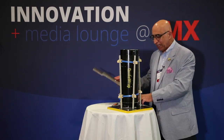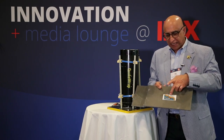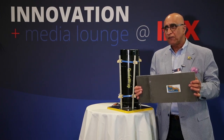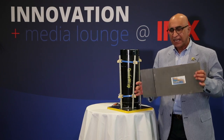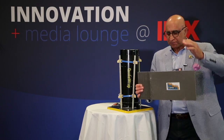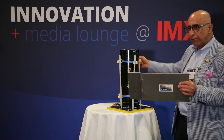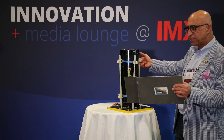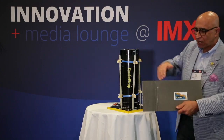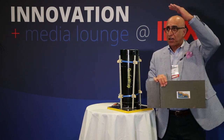The last product to show you today is our solution for repair of sea walls and bulkheads. This is called SPIRE, or the Sheet Pile Repair System. These panels are made out of non-corroding fiber reinforced polymer, or FRP, materials. They're pretty rigid, made in four feet wide by about 20 feet long. In the field, if you have a deteriorated sea wall, J-bolts would be connected behind the sea wall. These panels get put in front of the sea wall, four feet by four feet, with edges overlapped.